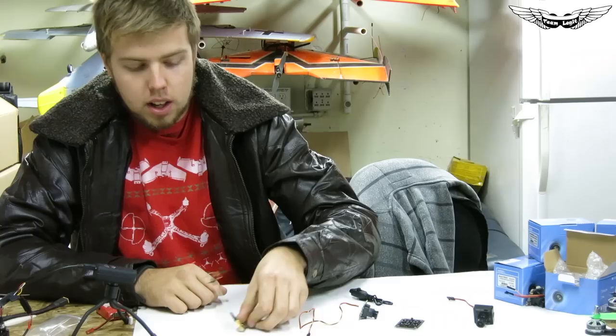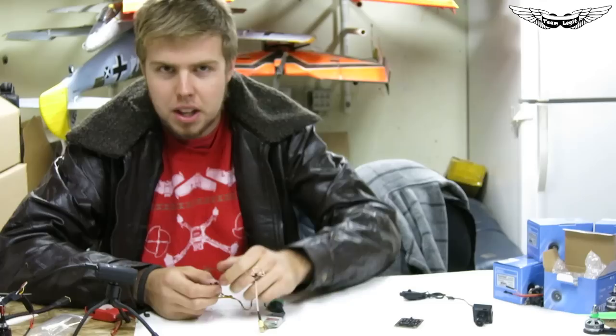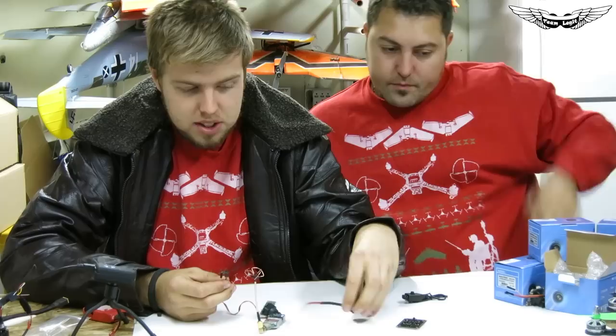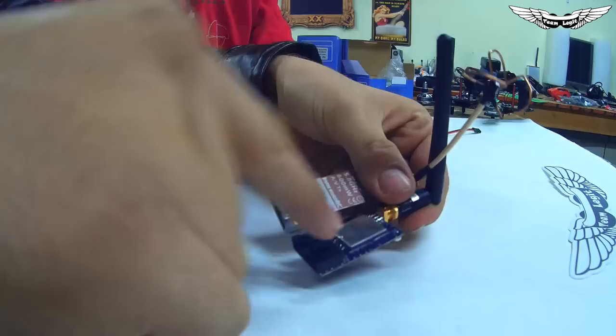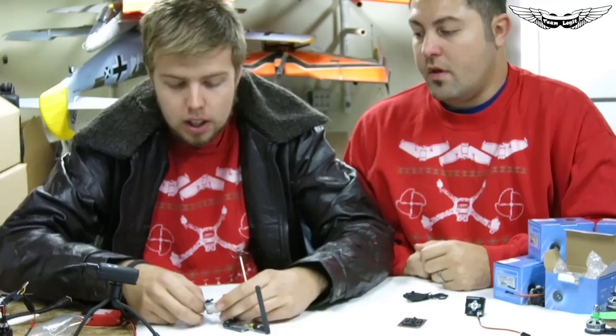Back in the day these used to come with all kinds of different plugs. I think the PZO428 — the plastic case version — came with just a bare plug you could customize. Now it's even more user-friendly; it's a ready-made RC camera. Be careful though — the Boss Cam polarity is totally different from other transmitters. I've toasted cameras that way. Tech tip: always check polarity before you plug anything in.